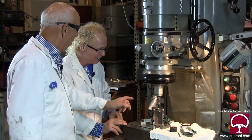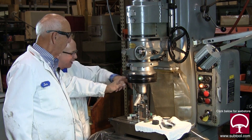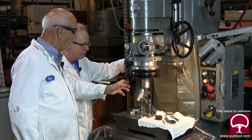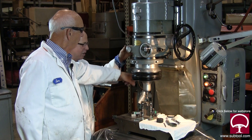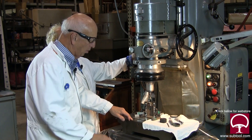This is another lubricator — it says auto feed lubricant. That one is for the ways and this one is for the spindle — it sends oil to the spindle and lubricates the bearings within the spindle. It just runs automatically when you turn the machine on.